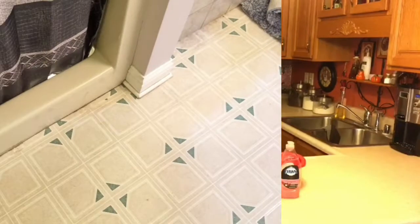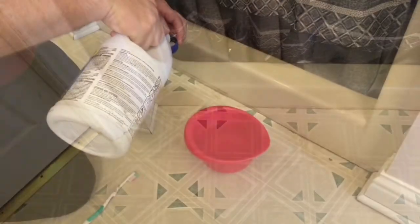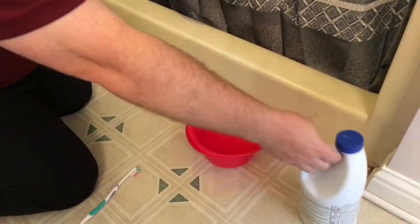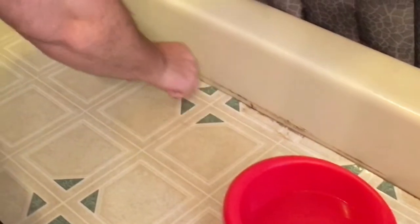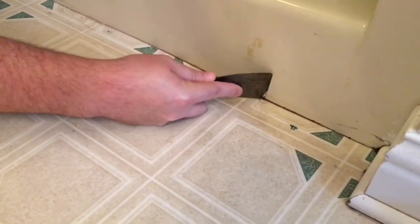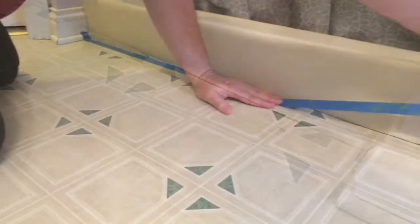So let's get started. The first thing we're going to want to do is clean this area up very well — it's an important step. Any debris or any of the old caulk that's left is going to keep you from creating that continuous bond that makes it watertight. We're going to take about a capful of bleach, put that in two cups of water, and this is going to help kill any mildew or mold that might be there. Some of that old caulk is very hard, so that's where we're going to need a scraper. Just be very careful not to damage your acrylic or tile as you scrape. If you have a complete area of caulk, you might have to start that with your utility knife.